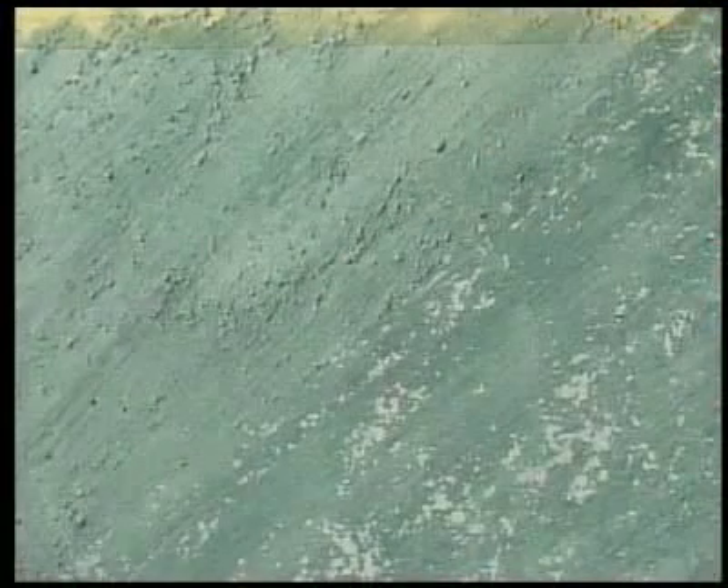About 15-20 minutes at 20 degrees Celsius, after applying the product, when the smooth parts of the paint work are dry, and while the rough parts are still wet, scrape the surface with a PV-77 special plastic spatula, trying to remove the particles which are standing proud.